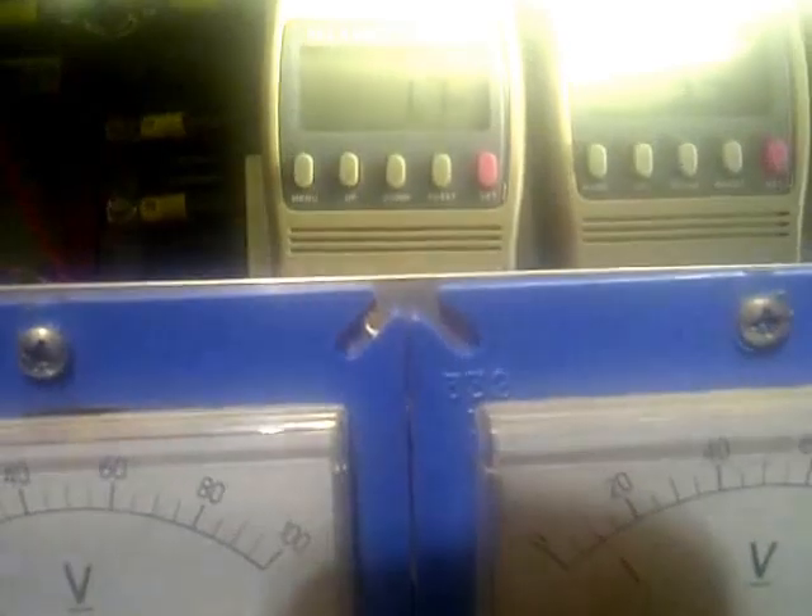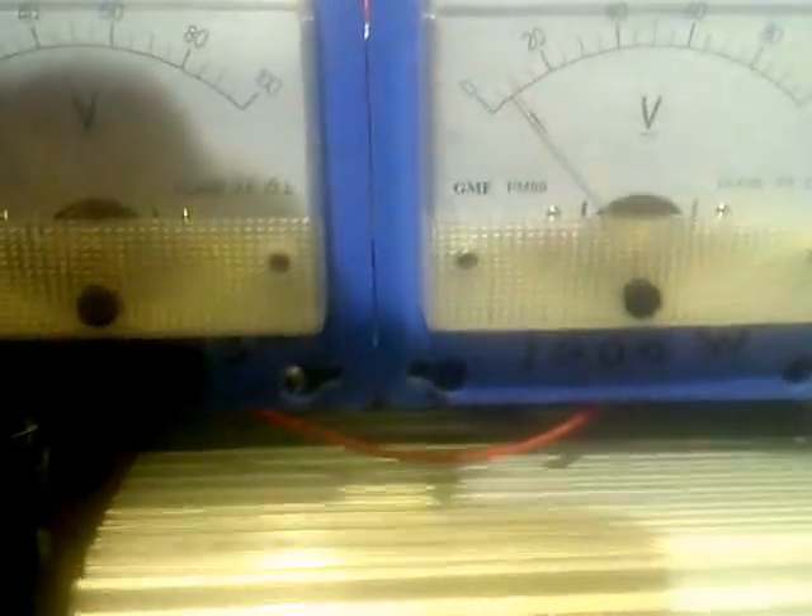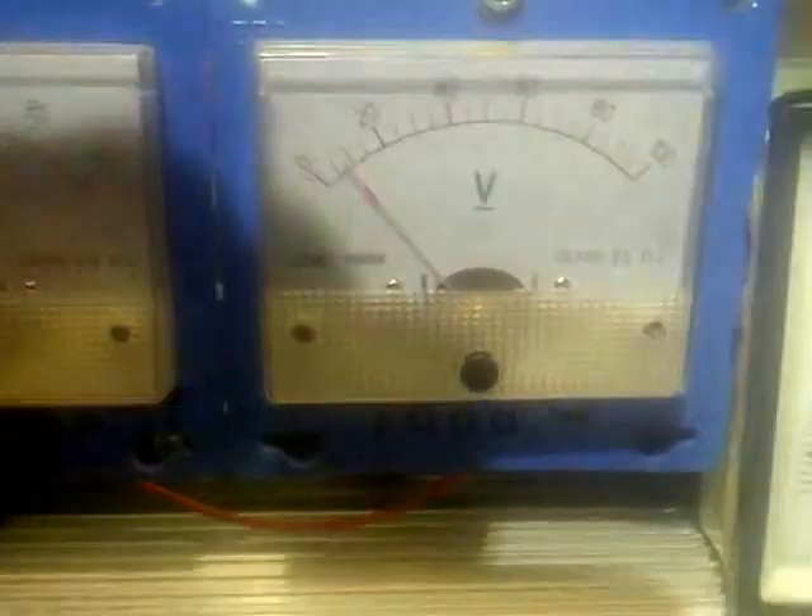So right now it's showing 5 watts, 3 watts — not a lot. Sometimes I'll get 150 out of it, sometimes nothing. But the objective is it can produce in lower winds, and that's what I want. Why would I want to produce only from 15 to 30 mph winds when I can produce from 7 mph up to whenever these big inverters overvolt? That's the whole purpose of it.